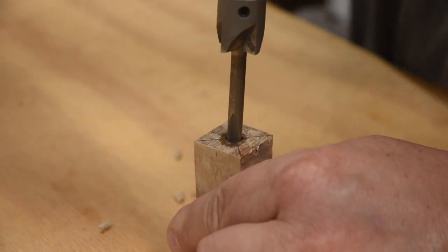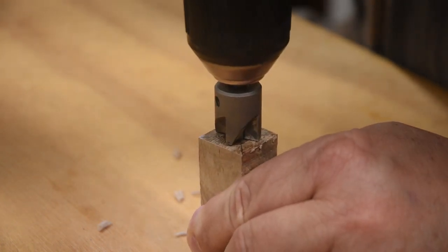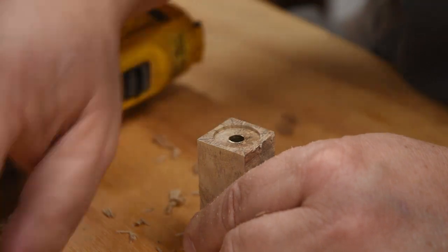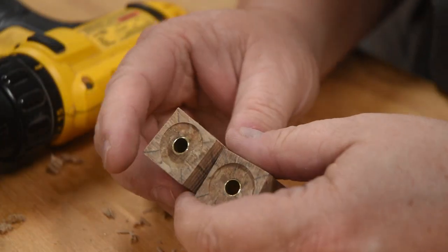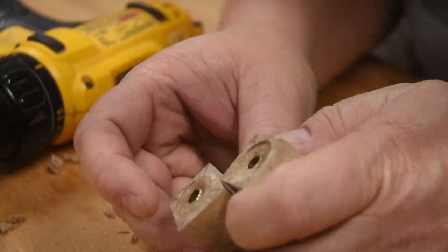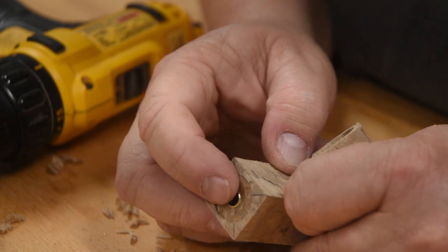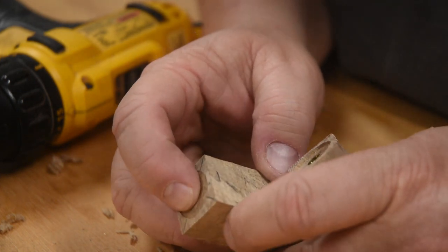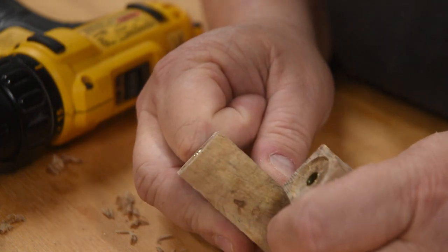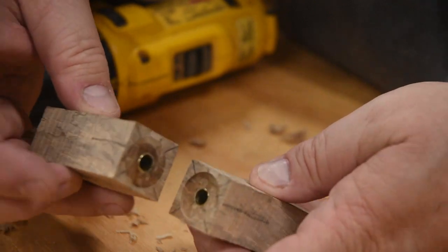If you watch my four-cuts video, you'll understand that this is the harshest cut you can do with any kind of blade — it is an end-grain scraping cut, so that edge I just created by sharpening is only going to last for ten to fifteen seconds. Start at the beginning to clear out the glue, come down until you see the shiny bit of brass — there we go, it's now flush with the brass piece. This brass is slightly proud right here; I'm not going to worry about it because when I assemble it and press it together, that should compress it a little bit.